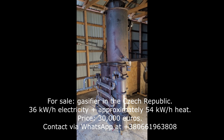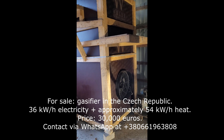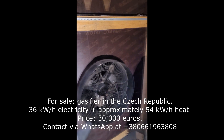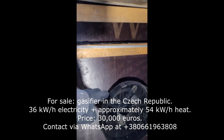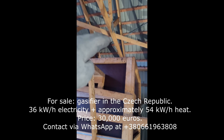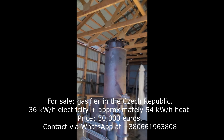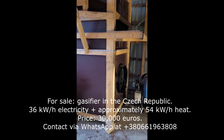This is our gasifier. Combined with the gasifier we have a bin feeder which is also used to dry the stock feed — the wood blocks. The gasifier's hottest part, which is this area, will be positioned right here with this big ventilator fan which sucks in all the hot air and blows it over the wood in a special way where all the wood is dried before it's used. New wood gets dumped in on top with a big bag and it gets taken out manually on the side and then used manually on top. This bin is built for this gasifier as well, and it is also a drying plant for the feed.